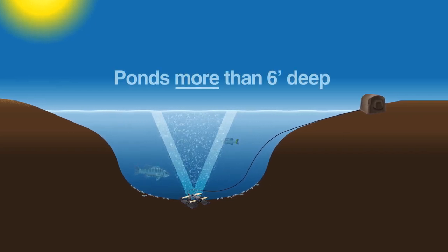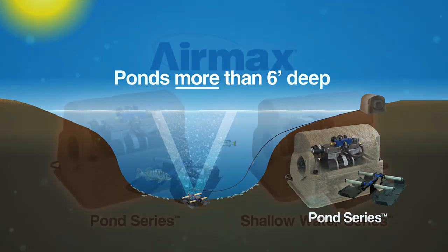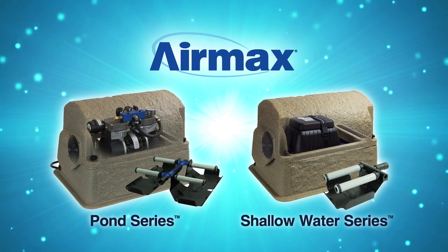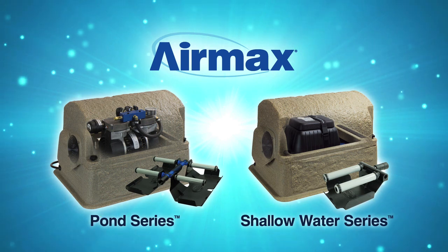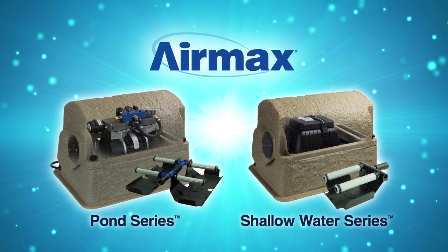For ponds greater than 6 feet deep, a pond series high pressure system is required. For ponds less than 6 feet deep, you will have the option of either a pond series or a shallow water series system. Please contact Airmax or your local dealer for help with selecting the correct system.